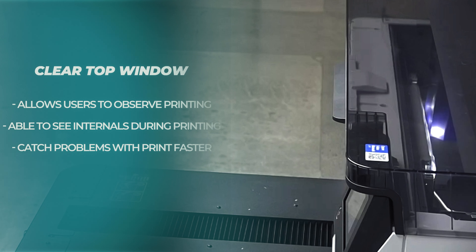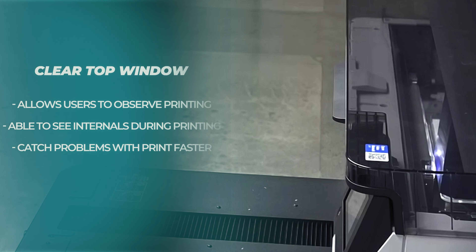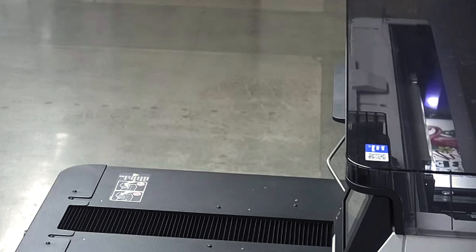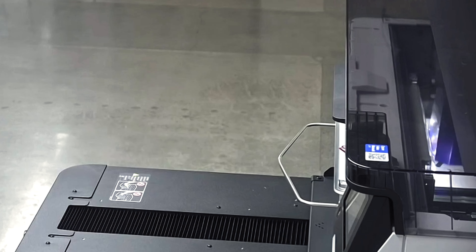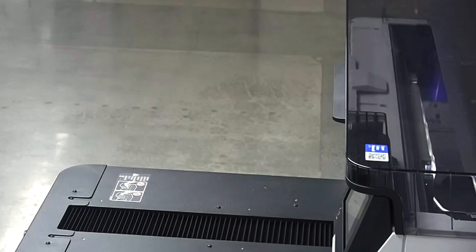On the top portion, we're looking at a much more visible screen as far as the lid to see the actual printing. We see so many times Direct-to-Garment printers running full production with that top lid open. While watching the printhead going back and forth laying down white underbase and brilliant CMYK colors is nice to see, you have to remember in print shops there's going to be exposure to fibers, dust, debris, and other things that can get into your capping station, ink lines, and printhead.